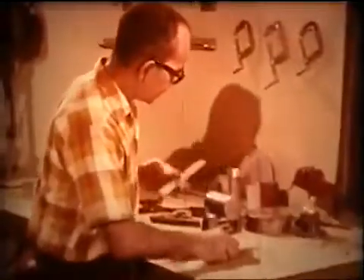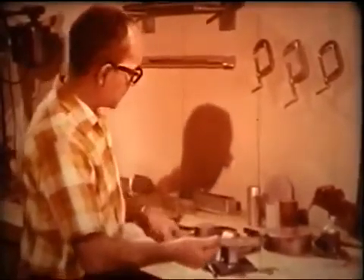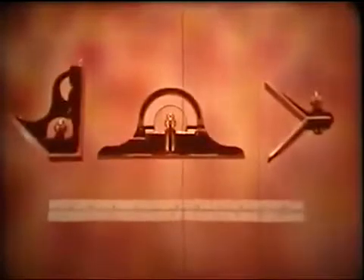Within the limits of its size, its shape, and its accuracy, the combination square can be used for almost every type of exact measurement. The combination square is basically a specialized development of the elementary steel scale and consists of a specially designed blade and three removable, adjustable heads.